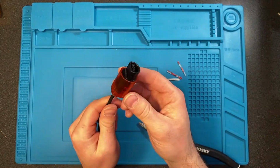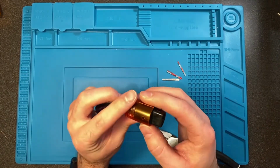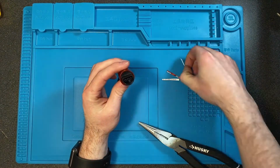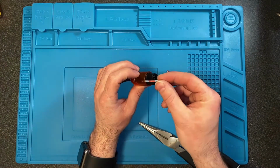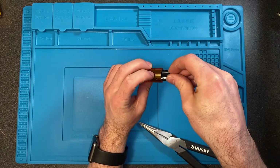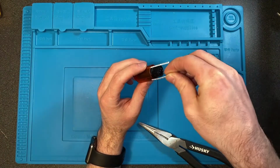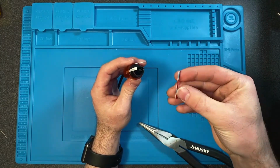Okay, so this is our plug on the original cord, so we need to remove that. The way that you do that, it's held in by 3 clips, there, there, and there. This is what we use a cut up credit card for, or gift card. This top one by the flat end is a little bit thinner than the other ones, so you're gonna have to cut a thinner strip for that. If you cut it too thin, it makes it bend very easily when you try pushing it in. So you're gonna put all 3 of those in, get all 3 started right away.